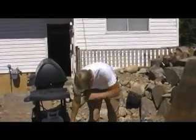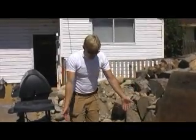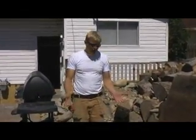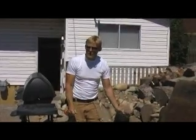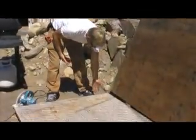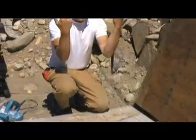The spacing on the plywood itself, I know you can't visualize it too well with it laying on the ground, is kind of up to you. I like 12-inch centers. In this particular case, I'm using 10-inch for a different reason. So what we're doing, this is going to represent the bottom of the wall. This will be standing up in place.